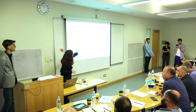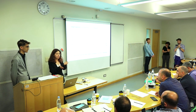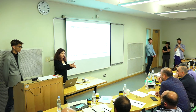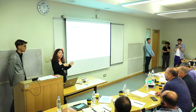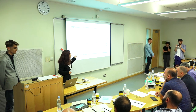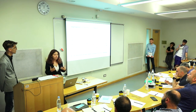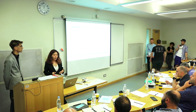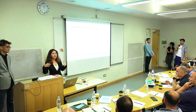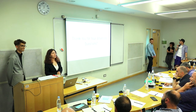So why would this help us? If they are symmetrical and straight, less force would be required to push or pull them, because with a difference in weight or asymmetry, instead of going down, it would just go sideways, because some part is heavier than the other. So we can minimize that. If the force is less, then the coil size can also become smaller because we won't need that much current, making the tablet smaller in size and lighter. And less current consumption and a smaller signal pulse would be required, so we would have better battery life, so more pages could be displayed. This is it. Thank you.